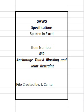839.4 Construction. Suitable anchorage/thrust blocking or joint restraint shall be provided at all of the following main locations: dead ends, plugs, caps, T's, crosses, valves, and bends, in accordance with the standard drawings DD 839 drawing series. 1. All mechanical joint restraints shall be bidirectional. 2. Anchor blocks shall be constructed solidly behind the fitting and symmetrical with the axis of resultant thrust, except where this is not possible as in the case of gravity anchorage for vertical bends.